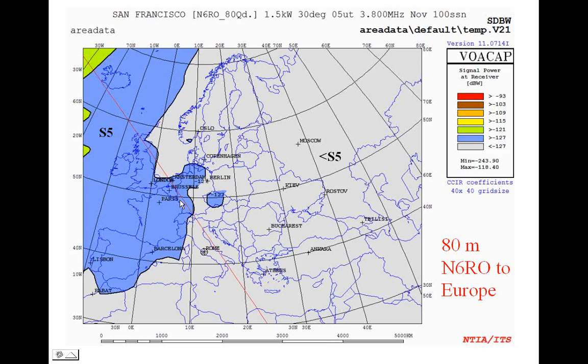This is about 3 or 4 years ago, when the East Coast was having a snowstorm, and they were having high precipitation static so that they couldn't hear anything on 80 meters. And I worked about 5 or 6 Europeans searching and pouncing on 80 meters from N6RO, but it took the two-element quad to do that, and it took some unusual weather conditions that disabled the other stations from being able to hear in order to achieve that.